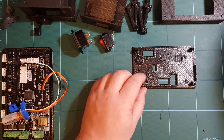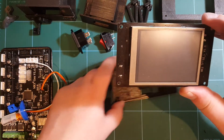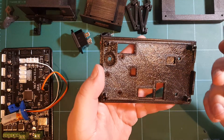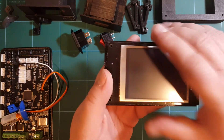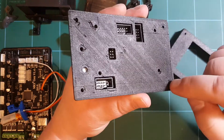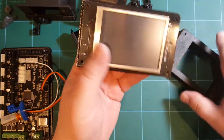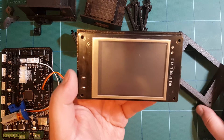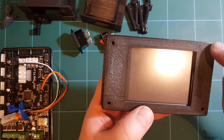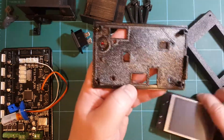I already mentioned this LCD display, and of course you need a way of mounting it and an enclosure for it. This is the enclosure for the LCD display — I found this on Thingiverse but I've modified it a little bit. The original enclosure had screw holes from the back; you had to assemble it from the back, and that won't work if you use the brackets I've added. So I've redesigned the front to have openings to put the screws through from the front, and you screw into the rear.